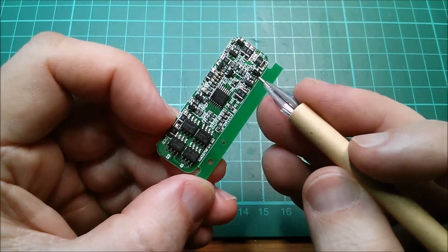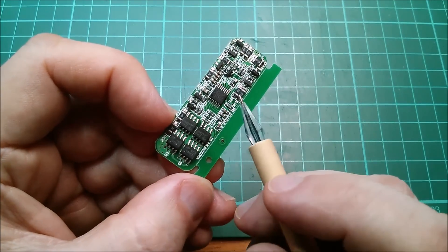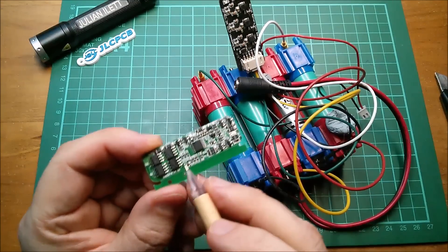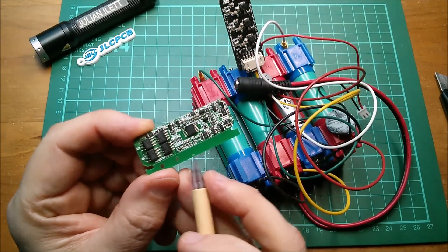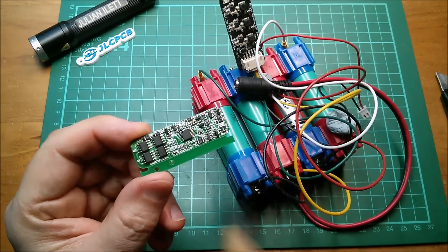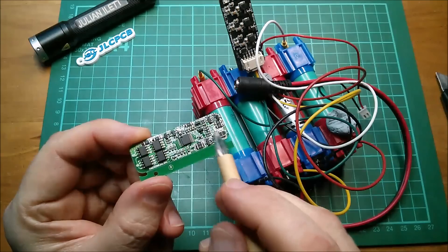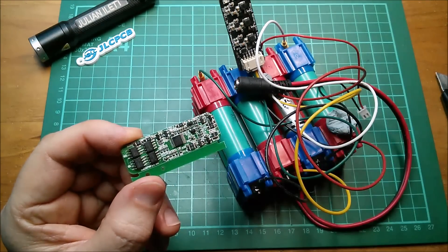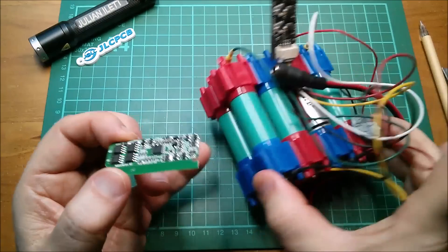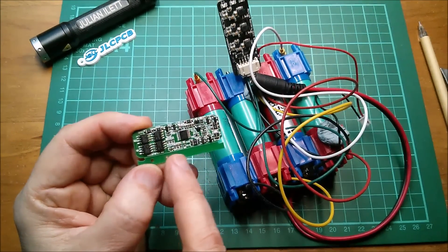Yes, this is a 4S, 4 to 5 amp BMS — so not particularly high current. It's so cheap though, like $1.75, and you get a lot of stuff on there. The idea was to put it on my lithium battery pack — this is a 4S 2P pack. This does the BMS stuff: shuts off the output if the voltage drops below a certain level. Then the active balancer — stuck on with Blue Tack — does the balancing part, which this board won't do. The combination of the two should make a fully functional lithium-ion battery pack.